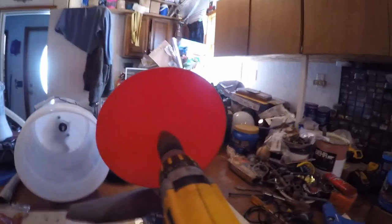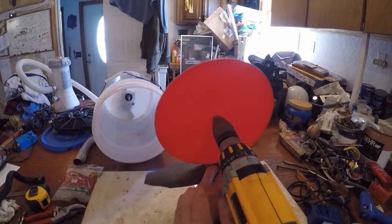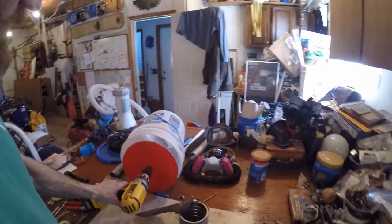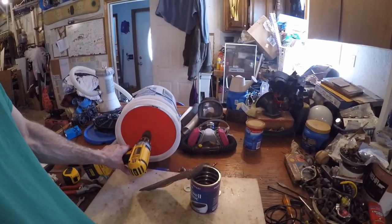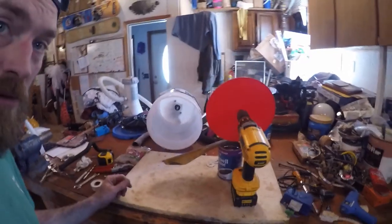I don't know if you got all that, but that should be showing the high spots and just taking off the high spots. Rather difficult to do, but it's working and it's giving me about as round of an edge as I'm going to get to fit as smoothly as possible inside that down at the bottom end. You can see there's that much taper to the bucket as you go down. So just keep working it a little bit at a time. I'll take that out and make sure it fits perfectly and then put it together and we're moving along.